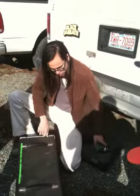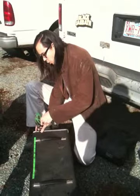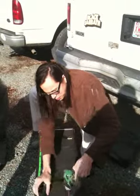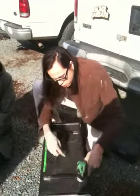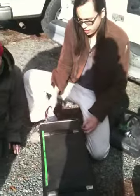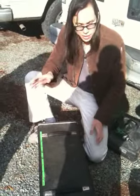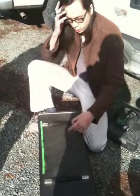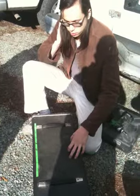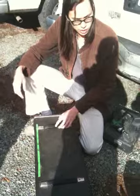Did you enjoy working on it? Yeah. Except this amp sounds great, and then you open it up and you're like, oh my god, the lead dress is terrible. It's just the way they strung the wires. Like, this wire should be next to that wire, and I wonder why, when you turn it on, it goes... It doesn't need to do that. It's just because the grounding's random, and there's AC wires and high voltage wires next to signal wires, which I started to try and phone out, but then I realized I'd do that all night long.